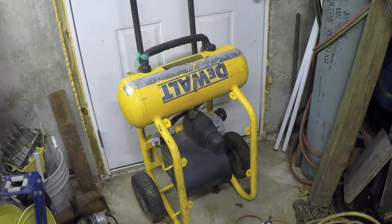That much we know. The 1.6 horsepower continuous, that may be on par with that supposed 2 horsepower on the Hitachi, because on the Hitachi they're not saying it's continuous, so that might be some sort of a peak horsepower or something like that. The interesting thing is they're calling it a 200 psi, but then in the features it says it's a 200 psi max tank storage pressure, provides a user with 80% more usable air than the industry leader. It doesn't say that this thing's necessarily set to actually shut off at 200 psi.